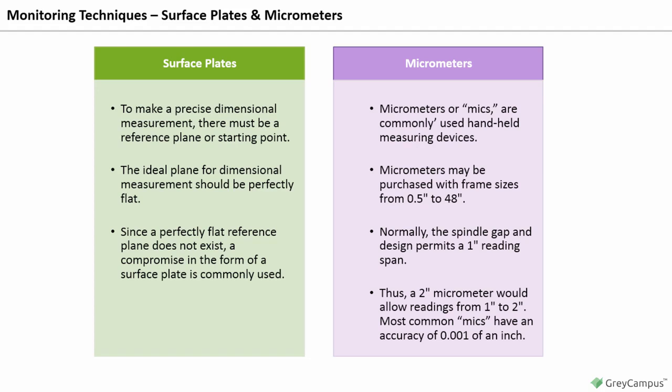The two primary scales for reading a micrometer are the sleeve scale and the thimble scale. Most micrometers have a 1-inch throat. All conventional micrometers have 40 markings on the barrel, consisting of 0.025 inches each. The 0.100 inch, 0.200 inch, 0.300 inch, etc. markings are highlighted. The thimble is graduated into 25 markings of 0.001 inches each. Thus, one full revolution of the thimble represents 0.025 inches.